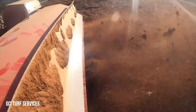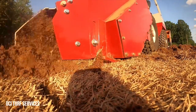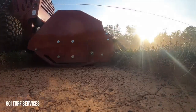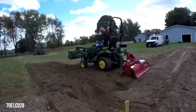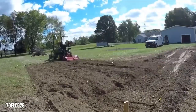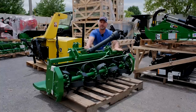If you want to open up the versatility a little bit more, a couple of interesting things that guys do to increase the versatility of their tiller is to actually use it for seed prep for a lawn. If you want to reseed an area, fall is a great time — but kill it off first, give it a good couple passes with a tiller, and you're going to have a really good seed bed to redo your lawn or hire out your services. And even redoing a driveway — if you have a lot of stone it's probably not going to work so well, but for those who just have dirt driveways that have been all rutted up and just need a good work over, I've seen quite a few folks on YouTube who have used tillers to rework their driveways, start fresh from an even level surface that you can tamp down and then cover with stone after that. Just another way to try to justify a tiller.